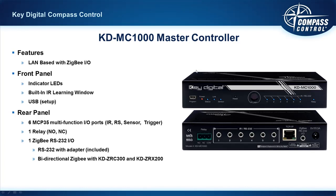There is a Zigbee RS-232 port. There's a special accessory that ships with the MC1000 that is a 3.5 millimeter three-ring four-conductor connector — it has an extra contact versus a stereo connector. That's because the Zigbee port, when used with our Zigbee antenna for the handheld remote, required power as well. So it's bi-directional communication: transmit, receive, ground, and power for the Zigbee antenna. That extra contact will be a non-connect when you use it with the RS-232 adapter. So you actually have seven control ports, one of them being a dedicated RS-232.